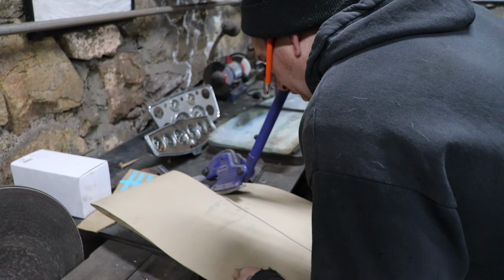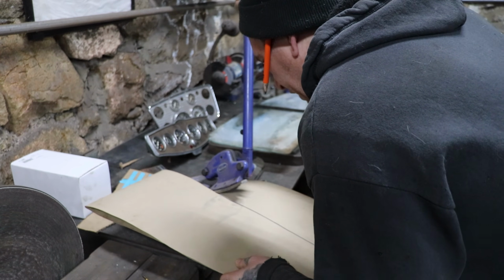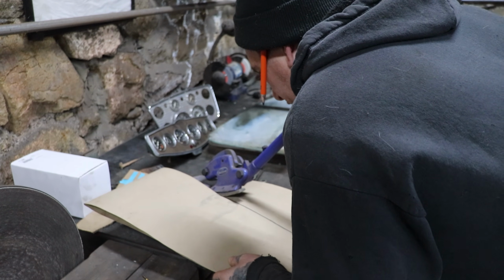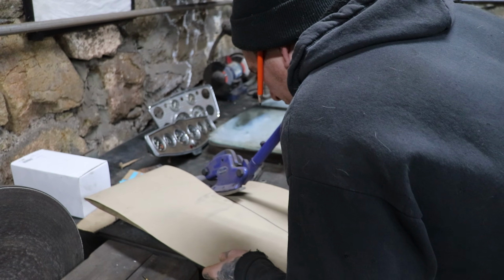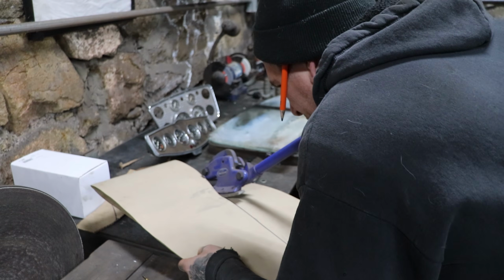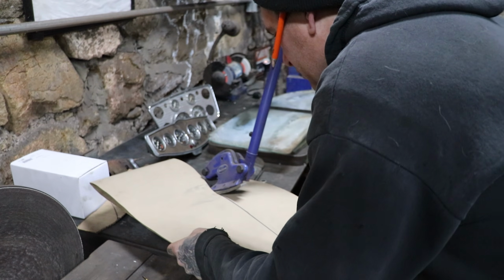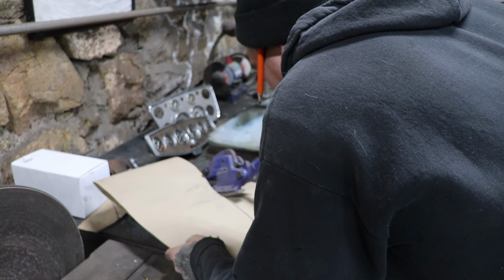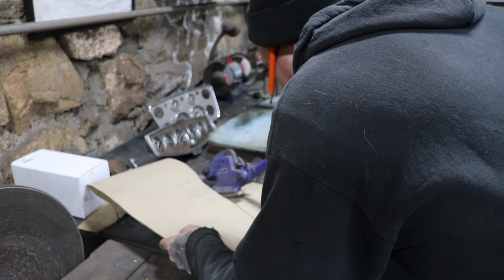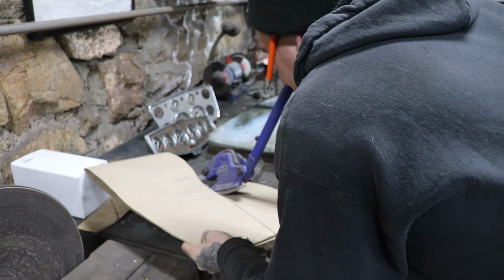I like to use the throatless shear here, a Beverly style shear, because with hand snips or hand shears you can wobble the panel a little bit easier and you get bobbles in it, kind of like you would when drawing it with a marker. Having the longer blade here gets rid of those small little bobbles on the panel or in the line, and it makes for a more even, smooth cut. And I'm treating this just like metal in how I'm doing this.